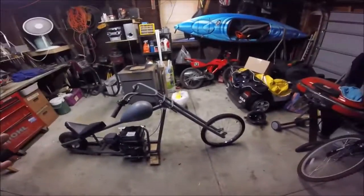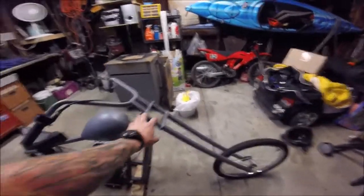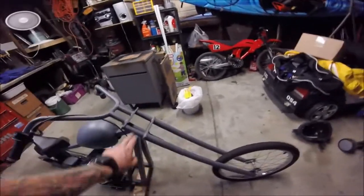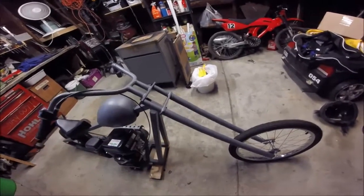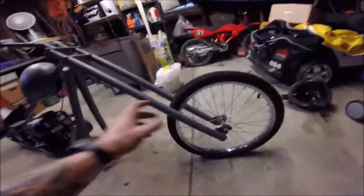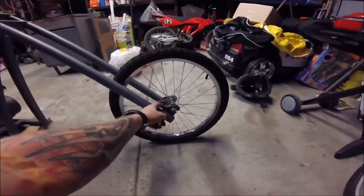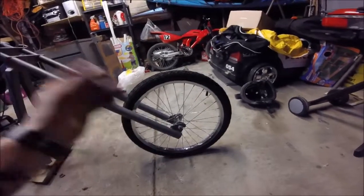The triple trees and front end have no suspension at all on this entire build, so it is a bit of a hard ride, but it's just a mini bike. These plates were lasered out at my old job — dimensioned from a mini bike design I found online. The inner side of the trees is just tubing, and the fork legs are actually galvanized electrical conduit — I had a drop piece that worked perfectly. Down at the wheel end, I looked at a bicycle, noted how the tabs were made, and fabricated my own from 3/16" plate.